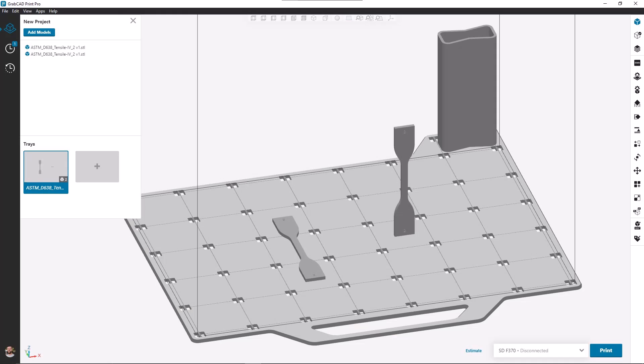The part was printed as we see on the left side of this tray. So when we threw it into the tensile tester, we're actually testing the XY strength of the part, which is already typically its strongest orientation. We could try printing the part in the vertical orientation on the right, which is kind of an inefficient print, but our Z direction or orientation is typically our weakest and where we might see the most increase in strength if we were to vapor smooth or brush.